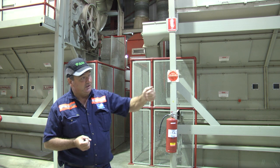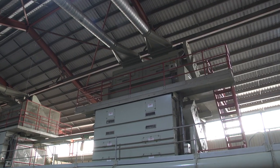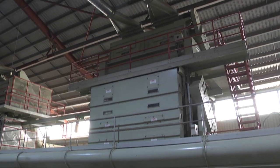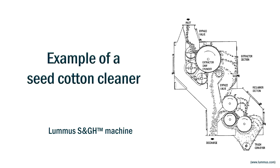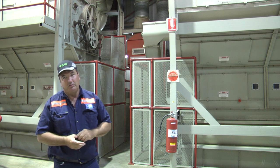We drop it into the air stream and it's picked up and taken through a tower dryer, conveying it through a series of shelves, which gives the lint a little bit more exposure to the heated air to dry it down. Once it goes through that, we start the pre-cleaning system. We generally run it over spike rollers over grid racks, and we're extracting the trash off the bottom. We pick it up with heated air again and take it to what we call the secondary pre-cleaners.